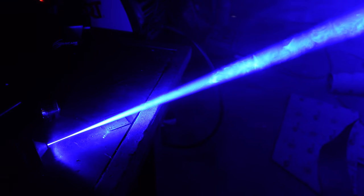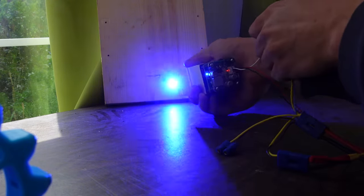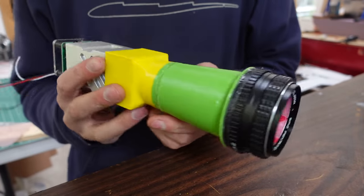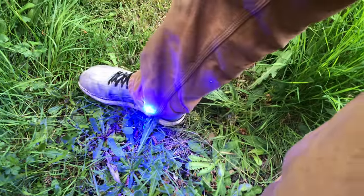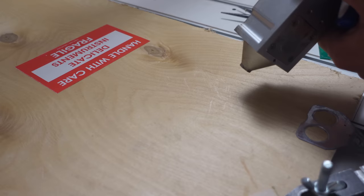The problem is that the focal point is only about 30mm away from the laser, so anything farther than that won't get cut. But I found that shining the laser through an old camera lens would give me a much narrower beam. This is probably a good time to mention how incredibly dangerous this is. It's not going to cut your finger off or anything like that, but a direct hit to your eyeball even just for a nanosecond would make you blind for the rest of your life. Those green laser pointers where you can see the beam in the air are only 5mW. This laser is 8000 times more powerful, so it's definitely something to be cautious around. Always wear laser glasses — and better yet, just don't try this at home.